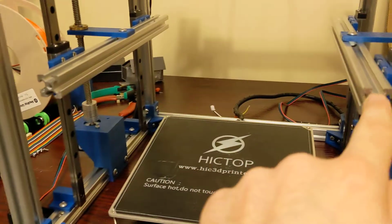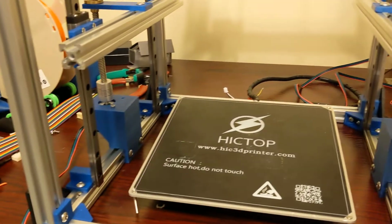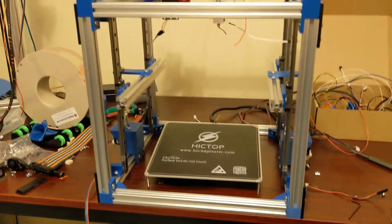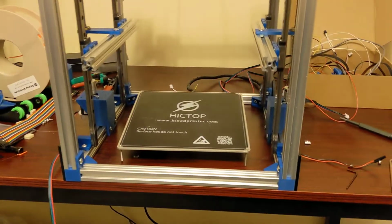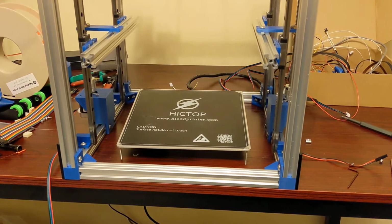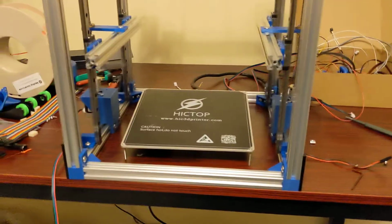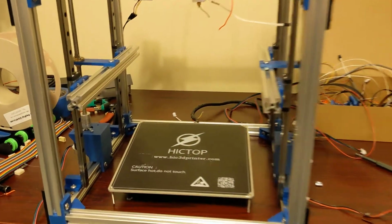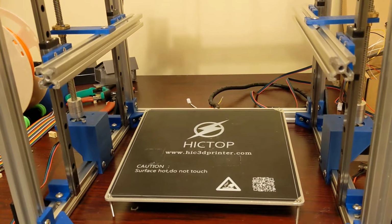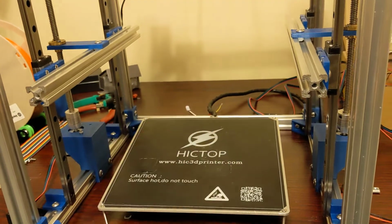You can manually set the height of each side here so that it's perfectly level, and then we will have an auto level probe that can compensate. So not a big deal, but if you're building a CoreXY for yourself and it uses 2 Z motors, definitely buy something like a Fysetc Spider or something like that that has individual steppers, and Klipper can definitely do tilt compensation. Same thing goes if you had 3 steppers, then you can actually start doing true bed mesh using 2 steppers on the sides and 1 at the back, and you can compensate for all of the tilt.